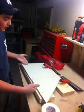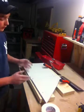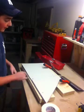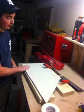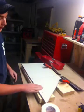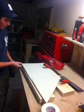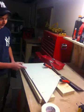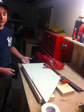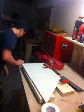So once you get two pieces of factory sheetrock together that are factory joints, you get what we call the recess joint. Now, a recess joint is different from a butt joint. A butt joint is when you have the thickness of the 1/2 inch drywall butted up against another piece. So if you don't understand, I have another example.